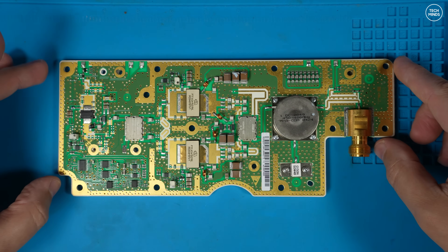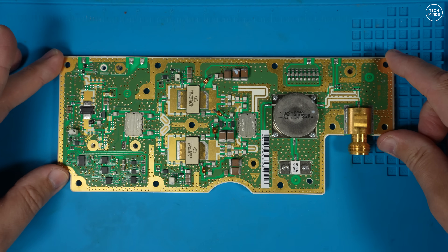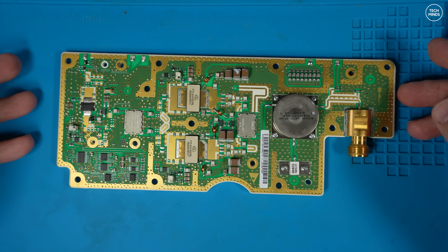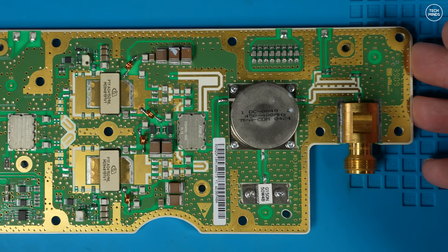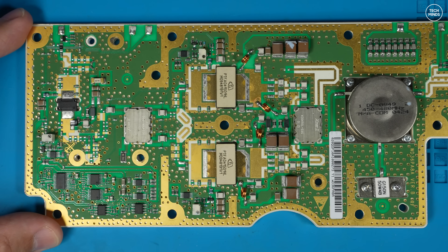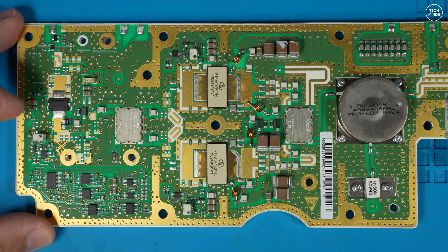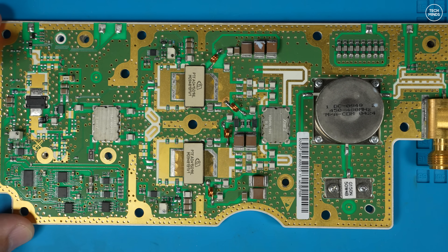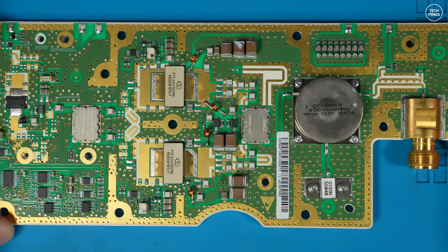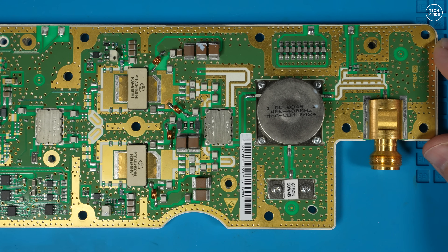What you can see here is an RF pallet that most likely came out of some commercial CDMA transmitter somewhere in the world. I got this from a fellow ham here in the UK. The circulator on the board states it supports a frequency range of 450 to 480 MHz, however we can perform some modifications so that this will work on the 70 centimeter ham band. I've been advised to leave the circulator in place but we can do a little trick to improve performance for our target frequency range.